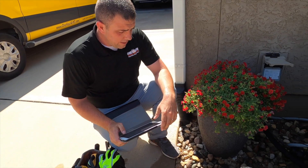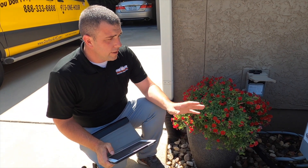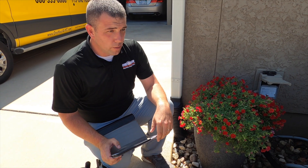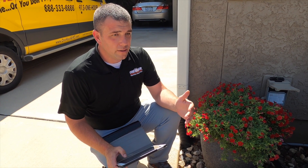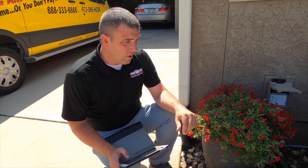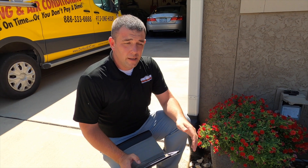The air conditioner out here is clean. It's operating like it's supposed to. All the amp draws are normal and the refrigerant is within the range it needs to be in. Downstairs in the furnace, their blower capacitor — we've been watching it for the last two or three visits. It's a little low. It's kind of like the battery that helps power that blower motor and keep it on line. We look for plus or minus 10%, which is pretty generous. It's at 18% low versus what it's rated at. So I'm going to explain what that is and where it is from last time to this time, and let the homeowner decide what makes sense.